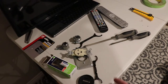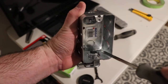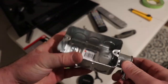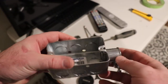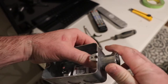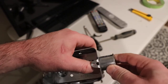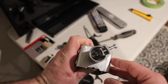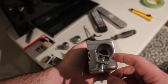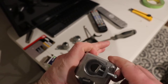If you're doing an electrical panel it's probably going to have a lip on it, so you're not going to be able to use it there either. Sometimes what you'll do is scrape off the paint on the electrical panel with a screwdriver — you chisel off the paint and then just hit the lock nut in. But if you have good access you can just put your thumb on it and turn it, practicing a couple of times until you get it to end where you want it to be.